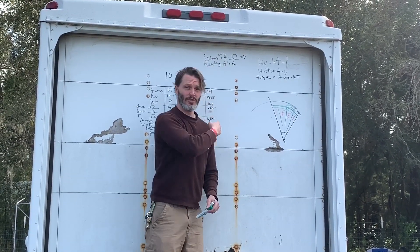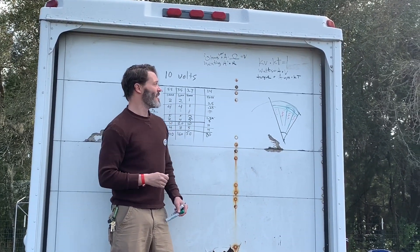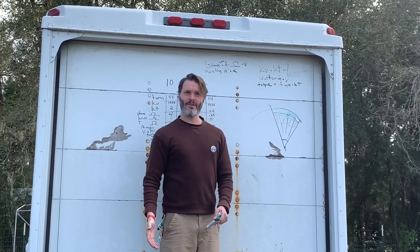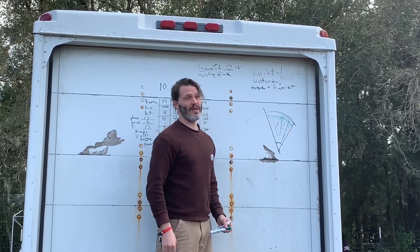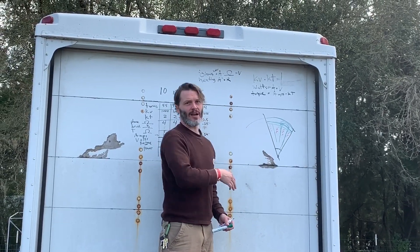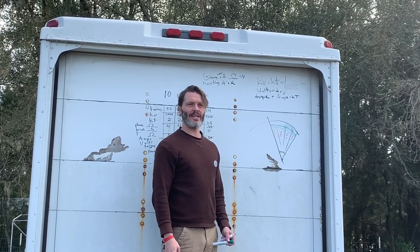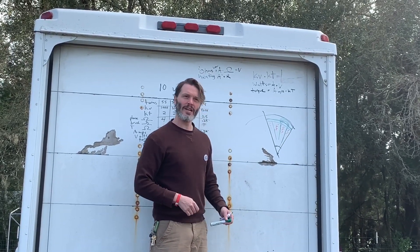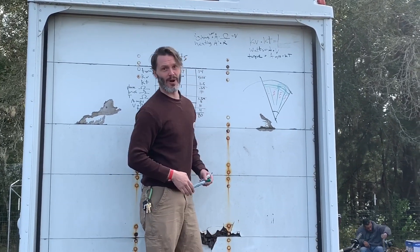This isn't a free meal of course, because when you double your pole count you also cut your RPMs in half. Doubling gives you more torque in this case, but there's no free lunch - we have to use the same gear-down at the rigs, the voltages available to us, and we want wheel speed out the back end. Double your pole count too many times and your motor won't spin fast enough to be useful. You can't have 100 pole pairs and still have a usable motor, and there are also design constraints around assembling and winding.